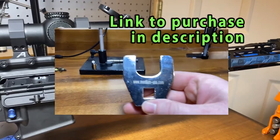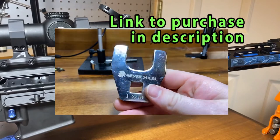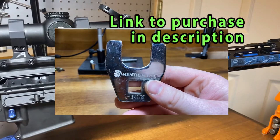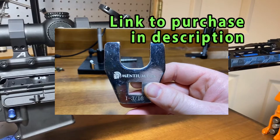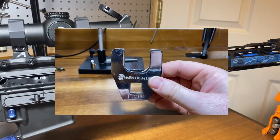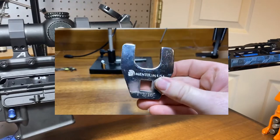I just wanted to do a little close-up here. This is the half-inch drive, one and three-sixteenths inch crow foot wrench that I used in combination with my torque wrench and breaker bar to torque the Iron City Rifleworks LRP barrel. They make these in a full range of sizes and they are meant pretty specifically for barrel nuts, but it is just a typical crow foot wrench so you could use it for other things as well if the size was right. The big difference between this and a typical crow foot wrench is that this is a pretty thin profile — these specific gunsmith wrenches do a great job.